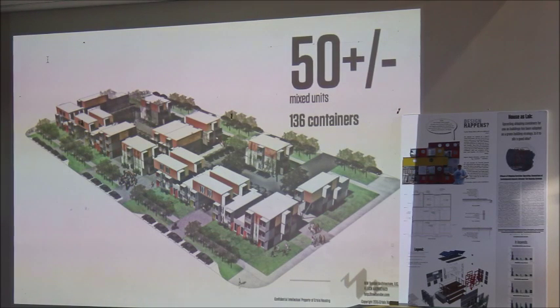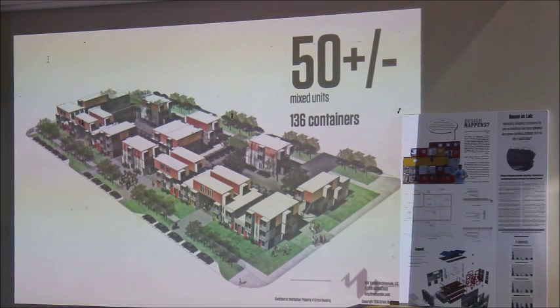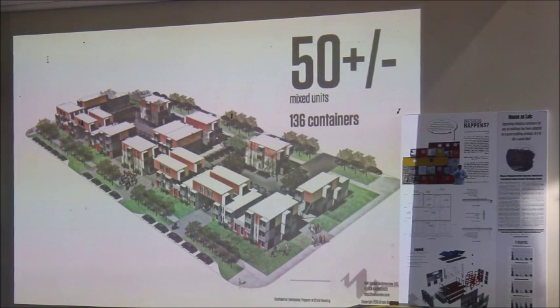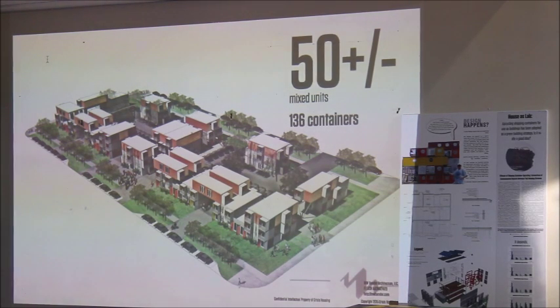And the other thing about that is that most of the containers are fairly standard. I mean, it's an ISO standard, but there's three different configurations of the bottom beam that can matter when you're putting them together. And so we've had to design ways of dealing with that. You notice that in those plans, we cut out all of the interior walls in there. So we've come up with a standardized way of reinforcing a container that uses very little steel, which is more easily implementable than sort of finicky cutting around, say, all the different profiles of the bottom beam. So really, it's a project of troubleshooting modularity.